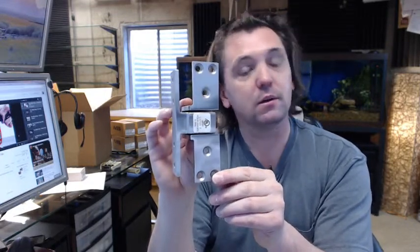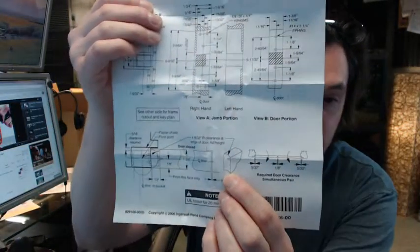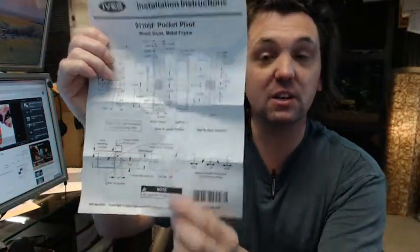It can be used on wood doors and metal doors. I have machined both metal and wood doors for this hinge — I have manufactured wood doors and had steel doors made to comply with these hinges. The doors are unusual in what the preparation has to be. For a wood door, there is really no easy way to create that concave radius — that 1-9/32-inch radius in the edge of the door. It would be very unusual to take a ball router bit and route the edge of your door.